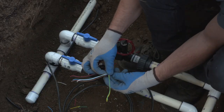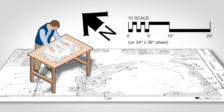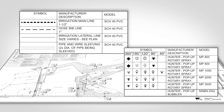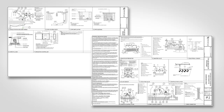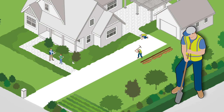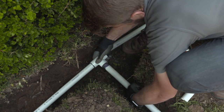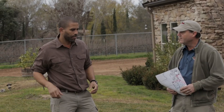Making sure you have a good understanding of the plans of a project is the foundation for all the work you and other professionals will do on a job site. Make sure you have a firm grasp of understanding scale on a set of plans and how that translates into the site on your walkthrough. Confirm that the legend symbols are as expected and reference them during your project. The details and the specifications should have all items of the project listed so there is no doubt as to what or how the project should be worked on. Finally, be prepared to keep track of the work that is actually done, as situations and circumstances sometimes change from what the plan intended — so make sure you note exactly where and what those changes are on your as-builts.